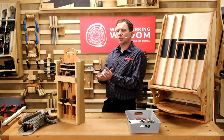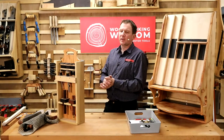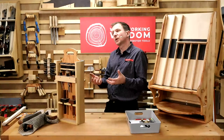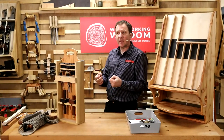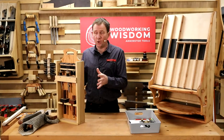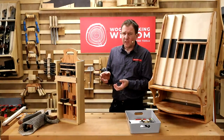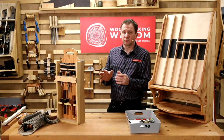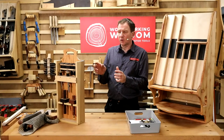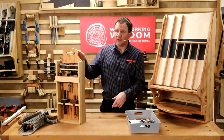We gave it that two-tone effect — we wanted something with a bit of a colour change. The birch ply is a nice way of just oiling up — it's quick, simple, low-odour. It will protect it a bit and stop it getting dirty. Even the boxes I made were oiled. On these we used a Liberon standard wood oil — something nice and thin, put it on, wipe off the excess. It gave us something just to protect them and bring the colour out a little bit.